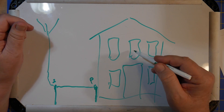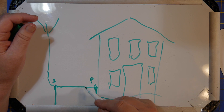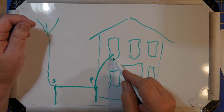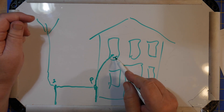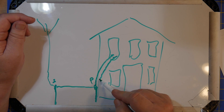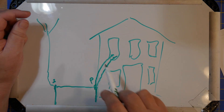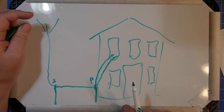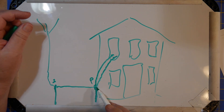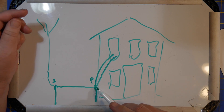Your equipment is up on the second floor. What you're going to do is bring the cable down to the ground rod, and then from here take the cable in the air. Also, you're going to have your single point ground for the station in here, and it also goes down to that same ground rod. Why can't you just go straight into the house? Because you don't want lightning to follow that path. You want lightning to come down to a lightning arrestor, then another lightning arrestor, and then into equipment that is grounded to that same ground rod.